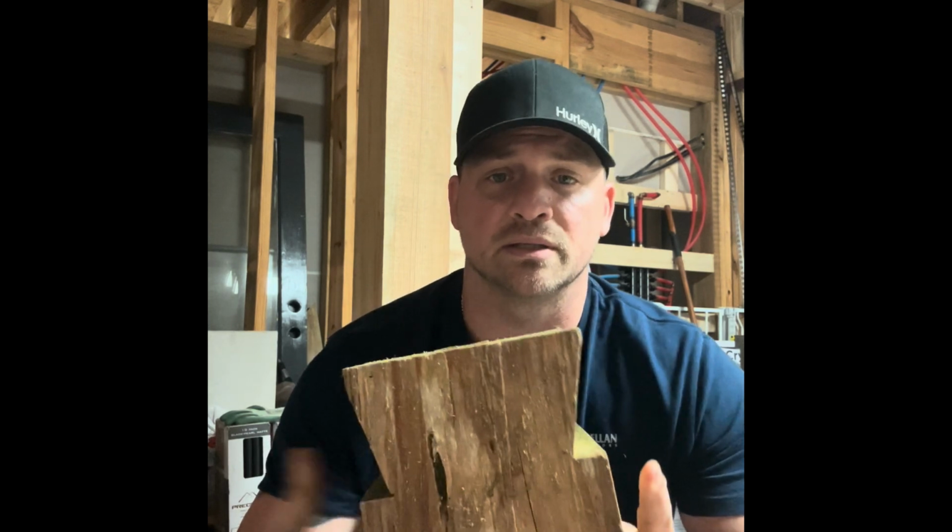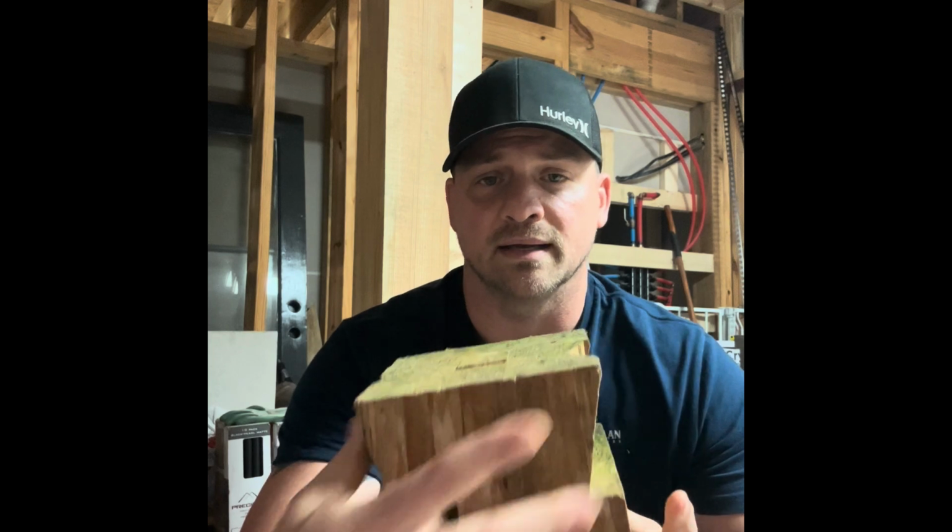The other thing that I made was the floor joist beams that have the dovetail cut out in them. I didn't get to record that, but I actually have a sample that I had done. It was the very first one I ever cut, just practicing on, and it's shaped like this, the same shape as the pocket, and all it does is slide in place and it locks down. And that's the only thing that's holding the beam together: the wood pegs and the floor joist with the dovetail.